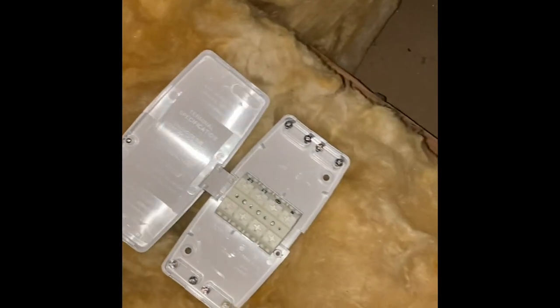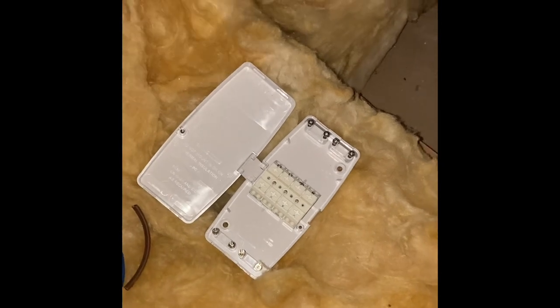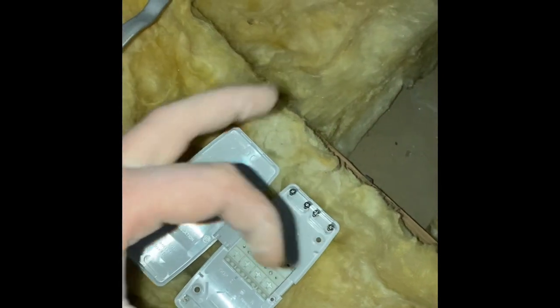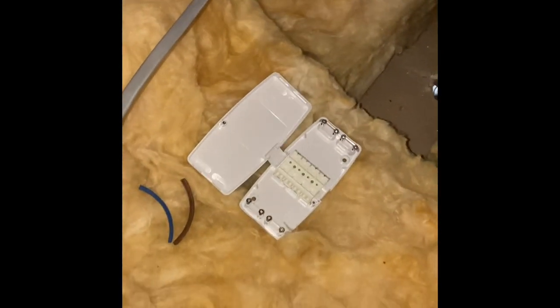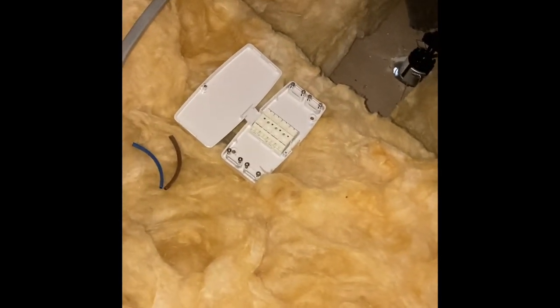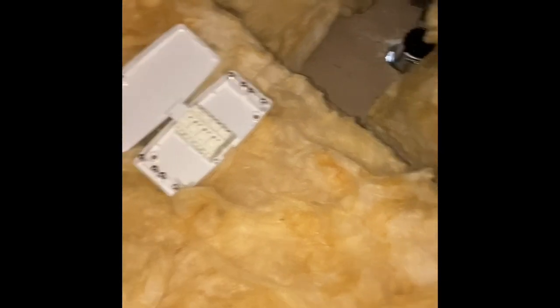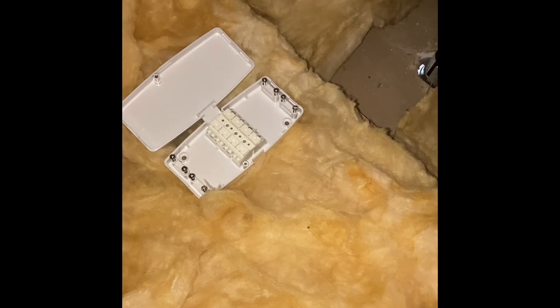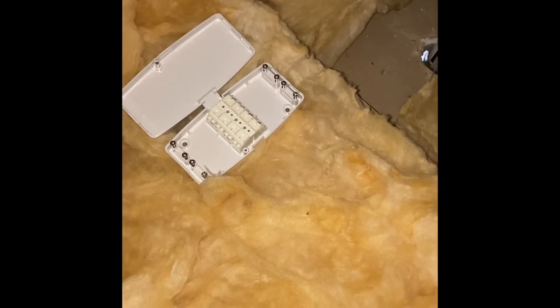This cable is the new cable from the PIR which I've just pushed up - the terminals aren't very big in it. The old cables go to the PIR. I've also brought up a maintenance-free junction box with cord grips. We used to use the old round style ones, but time and technology has moved on. Ideally you need the cord grips on them - the old ones you could just pull the cables and they'd fall out. These ones are fully secured; the cables aren't going anywhere. It's the professional way to do the job.